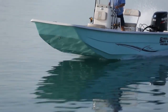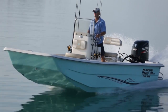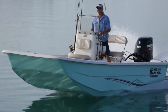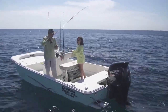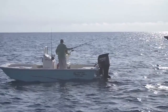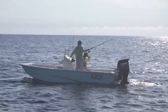This boat is one of those compromises we talked about earlier — it's a rolled gunnel boat, it doesn't have an inner liner. Inner liners are pretty, but basically an inner liner is a boat that's inside out. They look nice but they take up room because they come down on the inside and encroach on your cockpit. When you don't have an inner liner, you give up a little bit of fit and finish, but you end up with a boat that's rhino tough with maximum space available, easy to clean, and more value oriented.